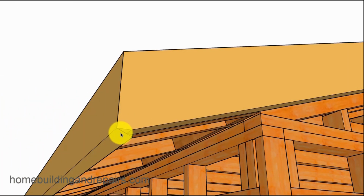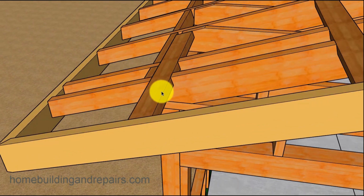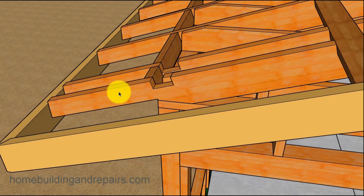And of course the bottom, it's not uncommon to have a bottom cut like this from the angle of the fascia board when you're coming into a horizontally level fascia board, and then you have one matching the roof pitch. Now I wanted to point out that I provided you with two different examples. Here we have a lookout that is at the bottom, and here we moved it up a little bit. My reasoning for doing that was to give you an idea of how this could actually weaken the overhang here. If you see when we cut it here, we only have 2 inches, whereas if we move it back, we're going to have a stronger part of the roof rafter here.